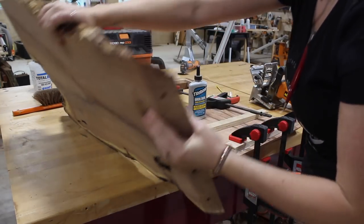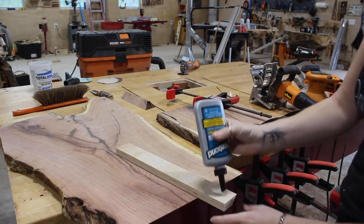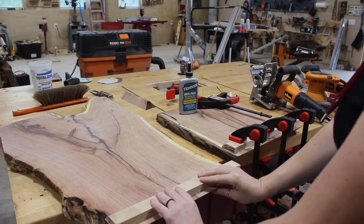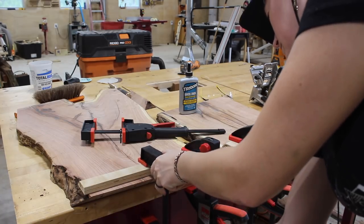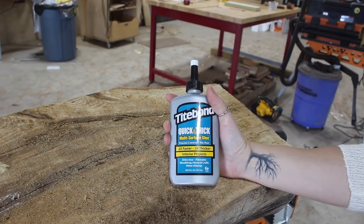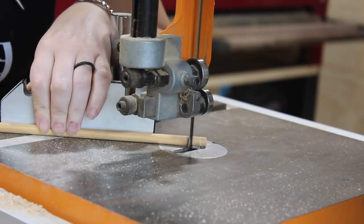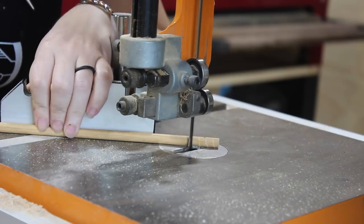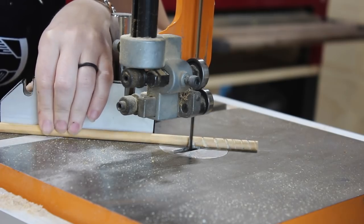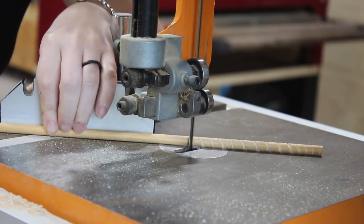Before laying down any glue I'm going to attach glue-up cauls made out of plywood, used solely to make clamping down on this joint a lot easier. I grabbed a scrap piece of plywood and cut it down the middle at a 45-degree angle, then glued them to my workpiece with the 45-degree angles facing away from the joint, using Titebond Thick and Quick since it has a very quick set time. While that set up I started working on the dowels - I always put in a spiral cut using the bandsaw with my miter gauge set to 45, gently rolling and pushing it through the blade.